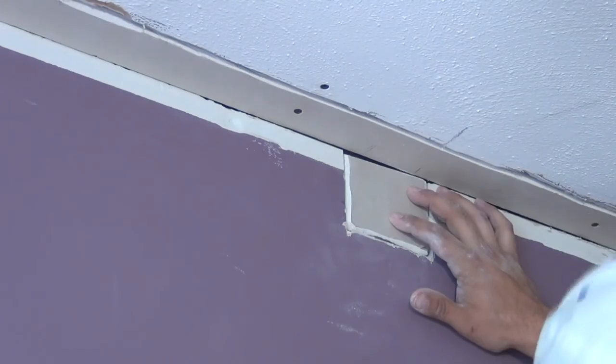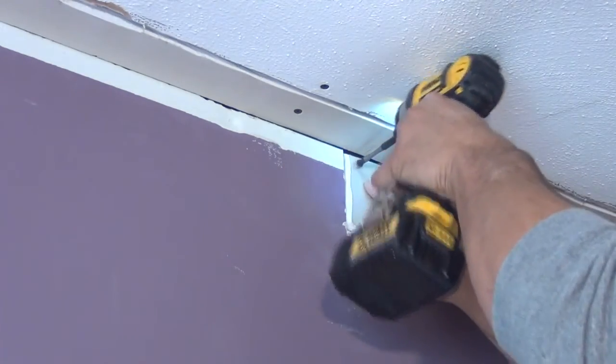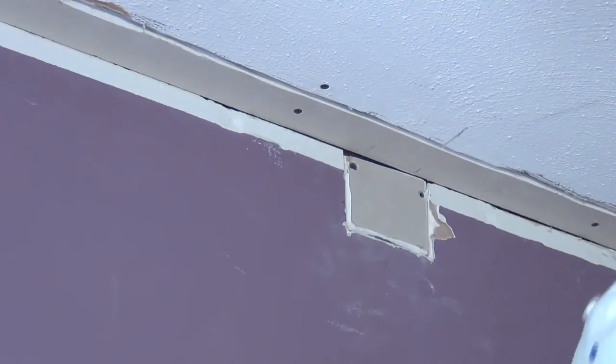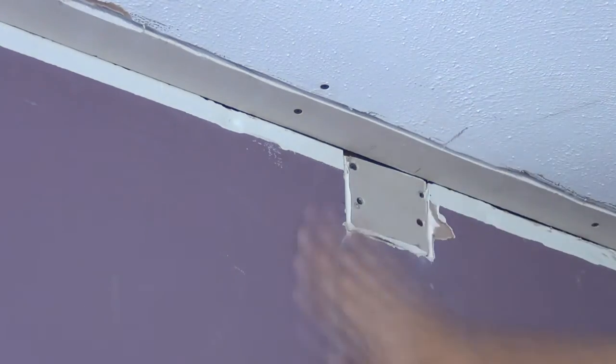Lastly, we just have to install the patch over the access hole I cut in the wall to run the wire, making sure I'm not hitting the nail protector plates installed underneath the drywall. And that completes the installation of the drywall for this video. In the next one, I'm going to start detailing the taping and mudding of this job, so click the links in the description or on the screen to go to the next steps. As always, thanks for watching.